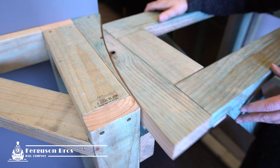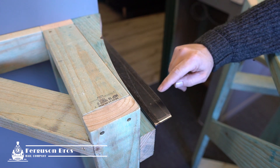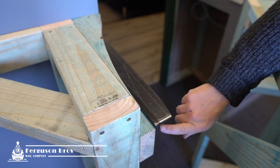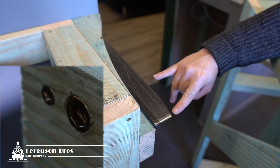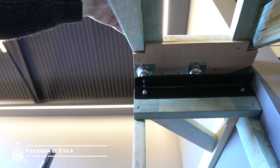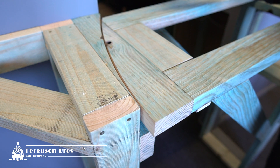If I open the gate you can see I've built a bit of 50mm angle iron which mounts to this board. I've filed the edges on this side so the ball transfer units can roll up onto it, and it's got bolts underneath so I can adjust the height to get it just right, so both ball transfer units are taking the weight of the end of the gate. As I shut this you can see it close from the top and the bottom — it closes really nicely. If I release pressure on the gate it just pops open just a little bit, which I'm hoping is just the right amount of tension when the latch releases.